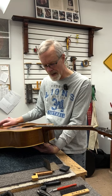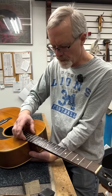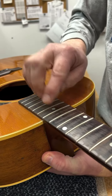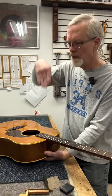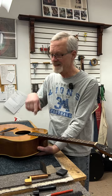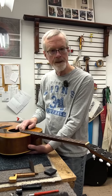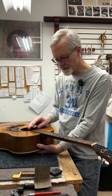So now I've done the frets too. One of the first steps to take the neck off is to loosen this fingerboard extension with heat to separate that glue line. At the same time, I'm heating up these frets so it makes it much easier to remove the 15th fret and drill those two holes down in there — that's where the steam goes in and comes out to loosen the dovetail joint. I put the 15th fret back in and leveled the frets, and I'm about to start polishing up those frets to finish that off.